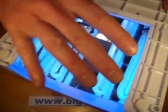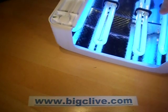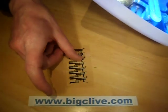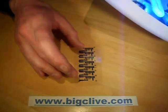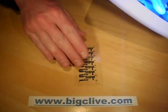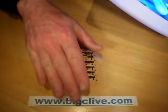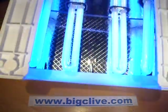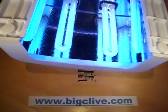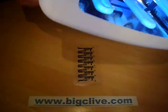Since it's got this nice big cut-out in the bottom, I got a bit of circuit board laminate and I put a transparency — I made a quick transparency up — put it on the laminate, put a bit of glass on top because UVA passes through glass, and that kept it flat onto the circuit board material. I stuck this over it and pressed the button for the two-minute timer and it developed it perfectly.